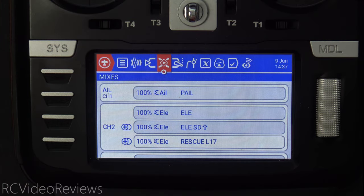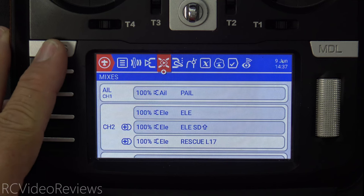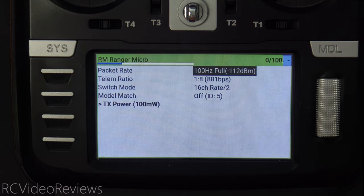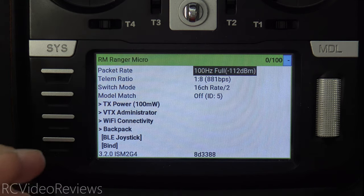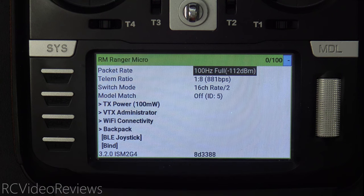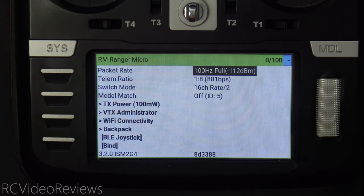The last bit is a pro tip for ExpressLRS users. When I initially tested this, I realized that sometimes it took the telemetry update just a little too long to arrive, and the plane got a little lower than I'd like. So I increased the telemetry rate on ExpressLRS. You can do that by backing out of model setup, pressing the system button, then the ExpressLRS button. I set my telemetry ratio to one to eight — so every eight packets I get a telemetry update. When I did that, I saw a much more reactive recovery mode. The telemetry updates came in faster, allowing the radio to pick up the loss of altitude quicker and activate rescue mode immediately. Normally this is set to one over 32, so I just increased the number of telemetry updates in my regular data flow between the radio and receiver.